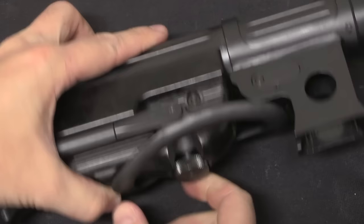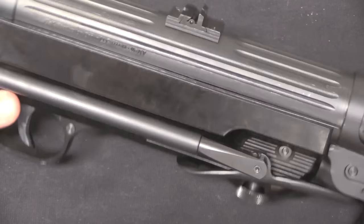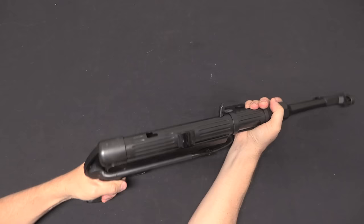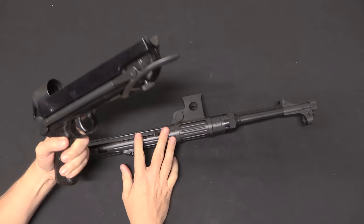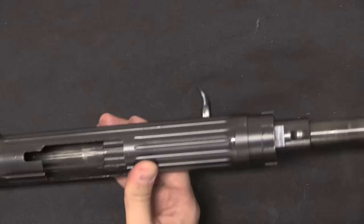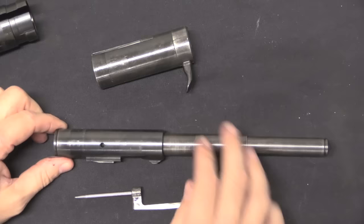Disassembly is going to be just the same as on an actual MP38. You've got this locking lug — pull it out and rotate it. You can see once you rotate it, it sticks out; this is a cross pin so it's either locked or open, and we just want it locked open. Then we take the whole action and rotate it until the rear sight hits the bakelite there, and then pull this right off. This is a really tight gun — DK told me that when they're new they are quite remarkably tight, so be aware of that. You also want to have it cocked when you disassemble it; don't dry fire it and then disassemble it or you can damage the internals. Inside we have a bolt and our recoil spring and guide.